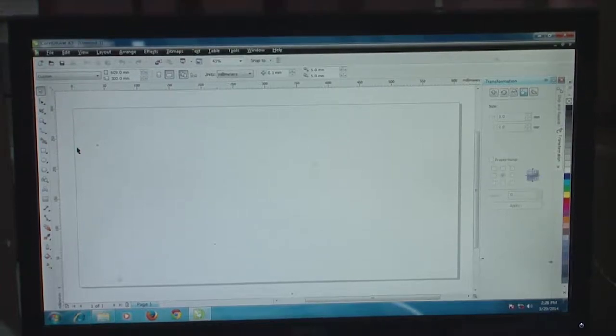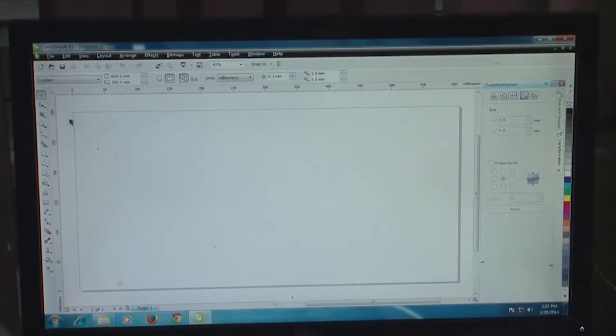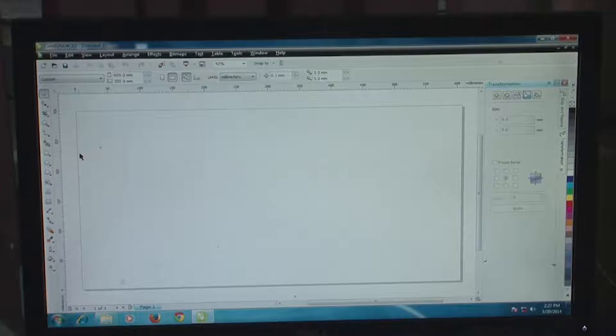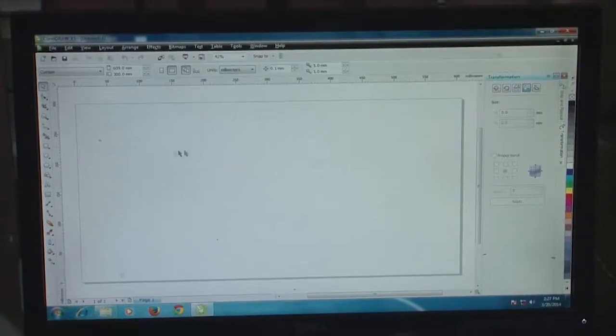And so just as in silicon based lithography we have a concept of die size, here also each device would be contained in a certain size or certain domain of this wafer, which is not the totality, and it's called one die. Okay, so we have multiple options of printing these dies onto this whole template, so that in one engravement we can have various shapes, features, sizes, etc. engraved onto the system, and then we can use either CNC milling or some other process, even band saw based cutting, to cut these die sizes out.